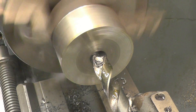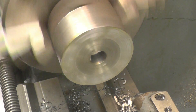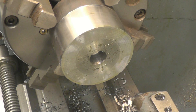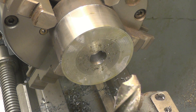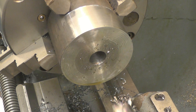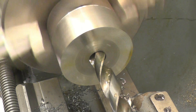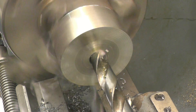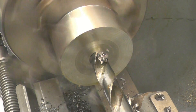That drill is pretty horrible — not a good grind at all. I've sharpened the drill freehand. I'm not the best drill sharpener in the world but I'm sure it will be a lot better than it was. It's actually cutting now — drilling the hole instead of tearing through it.